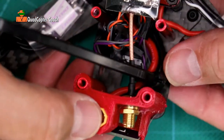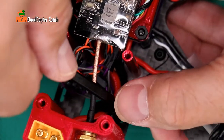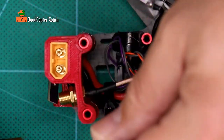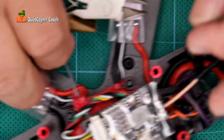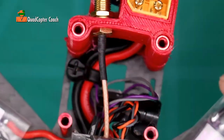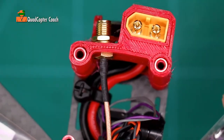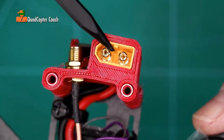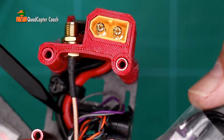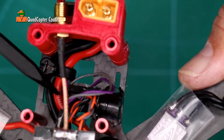When you are done, make sure that your XT60 connector is flush and not recessed, then ratchet that down as far as you can. Take your diagonal cutters and cut the excess off. Now we have a tie-down nicely securing our power wires and LED wires, taking the stress off of them. If we should have a crash and yank on the XT60, it's not going to put undue stress on these wires and pull them out of the power distribution board. It's very important to tie that down well to protect your XT60 and power leads.